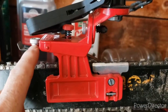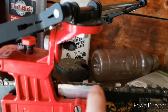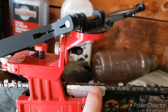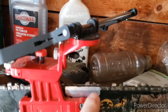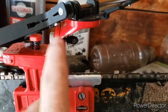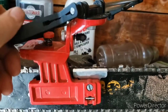You adjust this here so that when you move your chain forward and put it against the raker, it can't go any further and everything will be lined up properly. This knob is for lowering and raising this so that it goes in the gullet properly and not too much.